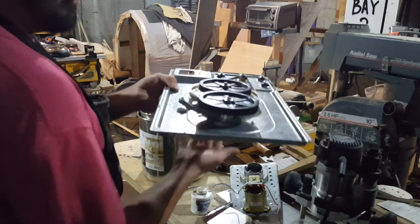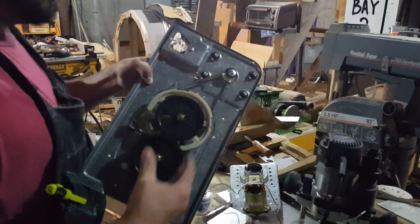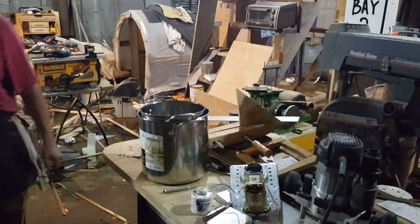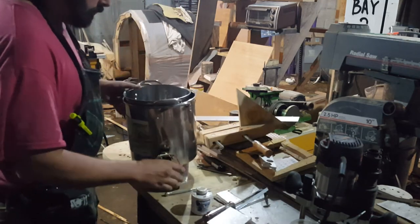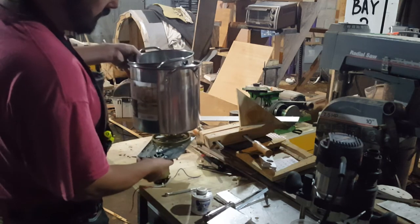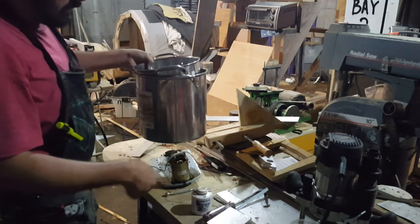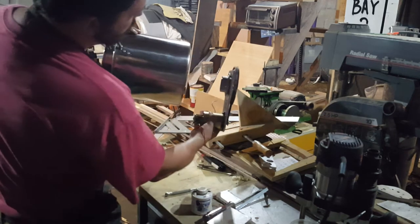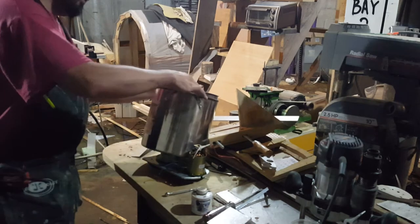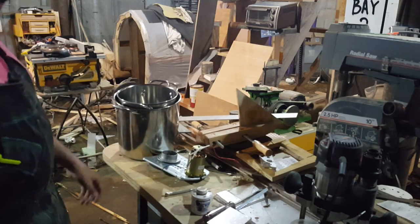It's a little bit higher torque, but a little bit more complicated with these two gears — that's a little bit more things that can fail. So we're going to probably go with the DC motor. It will be mounted to the back here, and I may mount it off to the side or turn it around. It will be held away from the heat and separated by a baffle, and I may put an exhaust fan in there just as an added measure. The whole unit will go together over a heater and spin the drum over a flame, and some baffles inside will keep the coffee moving.